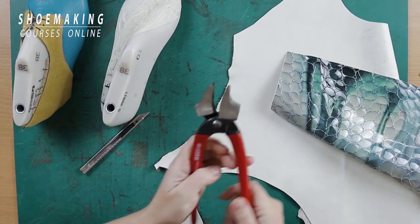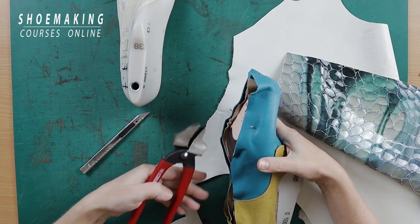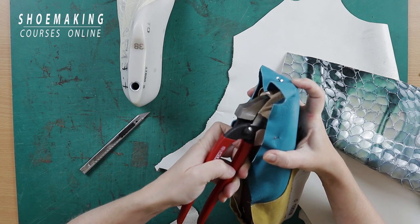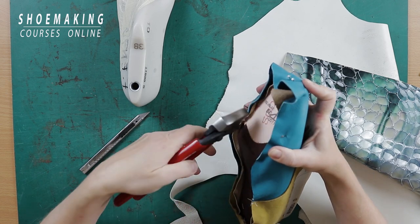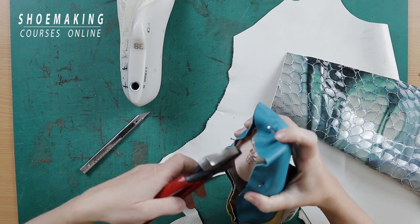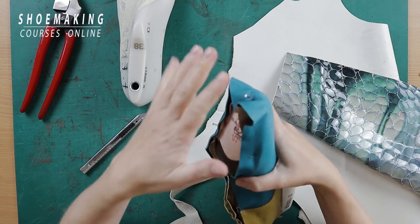When you last with pincers, you have the possibility to work very easily and correctly. You can pull each fold of your leather with the proper tool — pincers. You need to pull not only the upper; you need to pull the lining, the stiffeners, and the upper. Here you can pull and avoid any mistake, and in the end you will have a flat and beautiful shoe bottom.